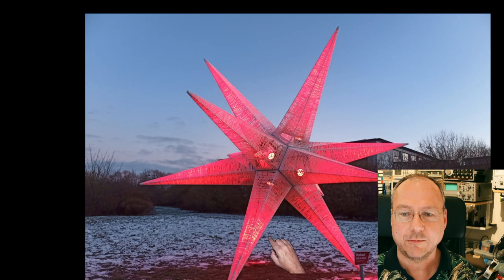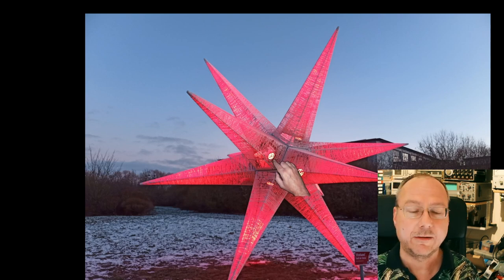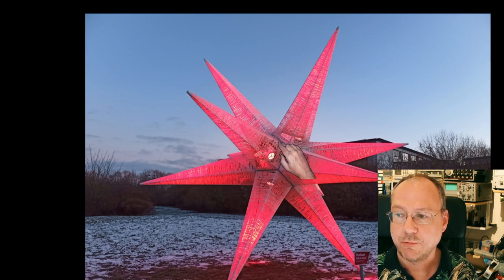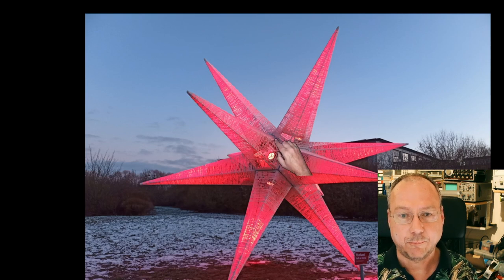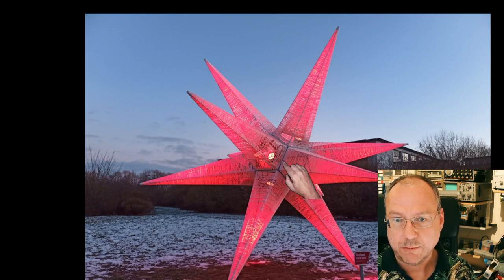And I wanted to make something like this, but on a smaller scale. So I got the idea that I can actually replace these powerful, I don't know how many watts LEDs here, with just one neopixel on each of these 12 faces, and then 3D print these spikes. I made a first prototype, I could say.